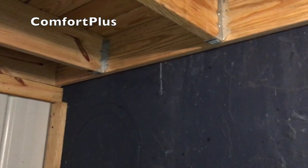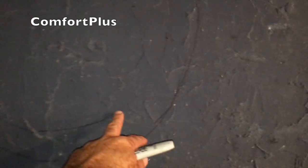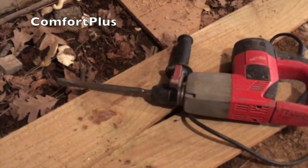Here we are under the addition on the back, where we're going to actually hang the unit from the floor — used to be deck joists. What I'm going to do is knock a hole through this wall. This is a 16-inch duct with extra room for insulation. I'm going to get a hole started through there before I hang this unit up, because it's easier to get back here. I've drilled a little ring of holes through the cinder block — it feels like it might be a 6-inch block, maybe even 8. I'm going to take this chipping hammer now and start making a hole.